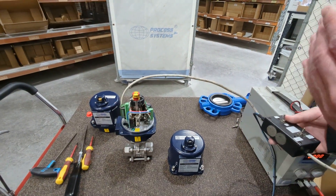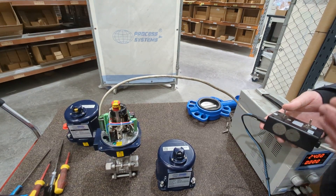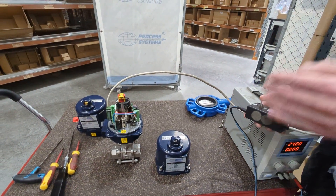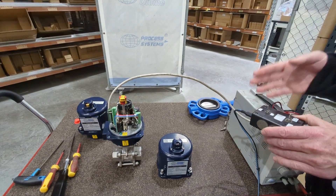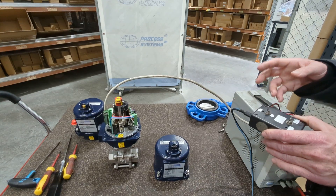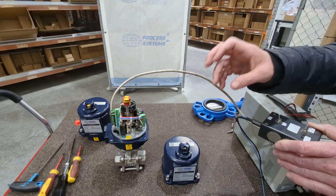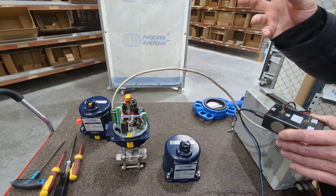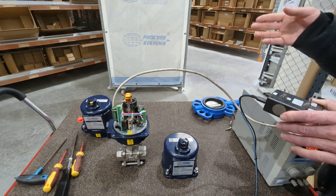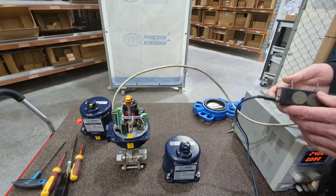This is an electric motor with a gearbox, so if you lost power it's going to stop wherever the valve position is — it doesn't have a fail-safe position. You can get a spring-return electric actuator but they're rather expensive compared to a pneumatic. This one takes about six to eight seconds for a cycle, and a cycle is a 90-degree turn from fully open to fully closed. Some of the larger ones may take 10 to 12 seconds, so you need to think about your cycle time.